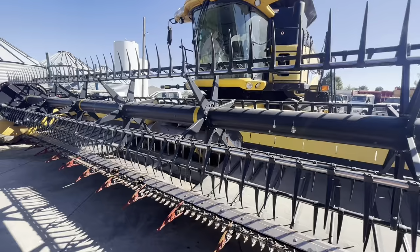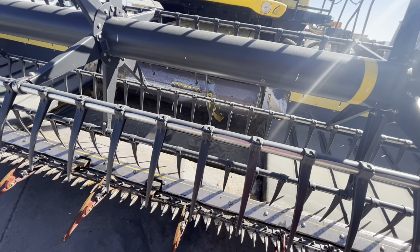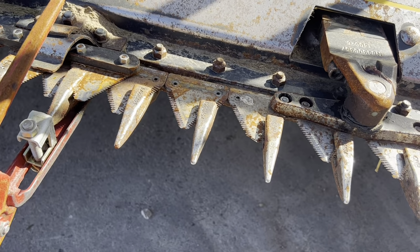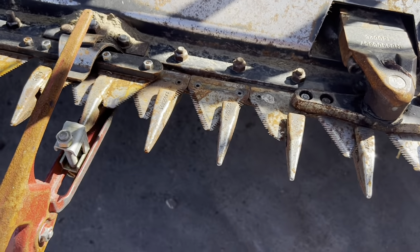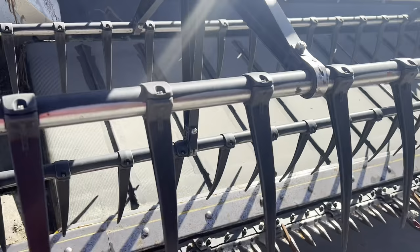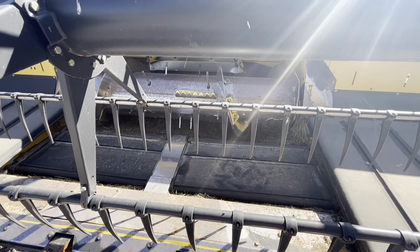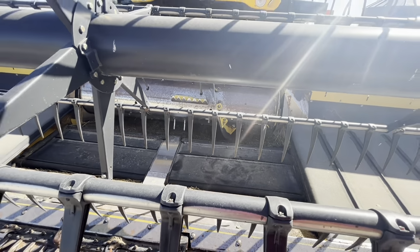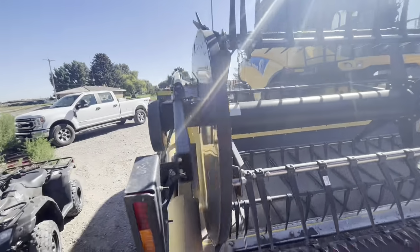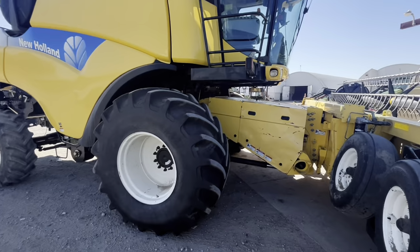So back over to the combine. How this works is these spin around and just help push the grain in straight. It has these knives down here that move back and forth like this, and it cuts the grain, and then it falls down onto these belts and comes into the middle, where this auger here kind of picks it up and feeds it into the combine. Now, once it goes in there, there's two big barrels, and then inside the barrels are these big grinders.